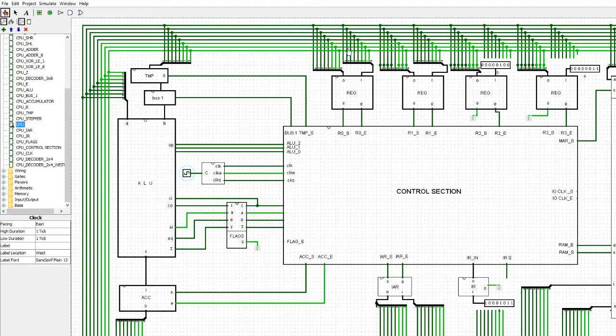So we've got 7 on the bus. Now, because I've nobbled this so that I can put an input in here and we can see the addition, we can't actually add that in because I've broken that wire. This is a point where I've taken the beautiful, perfect CPU, which I couldn't really do much with because it's not fully functioning yet, and I've broken a wire in it in order to put an input in. So we can't take that and stick it in here. But the answer here is 7, and it would be placed into this register if that was connected together, and that would say 7. I think you can see that quite clearly.